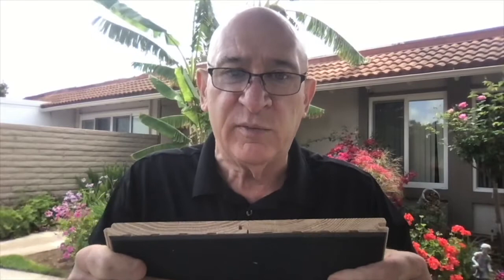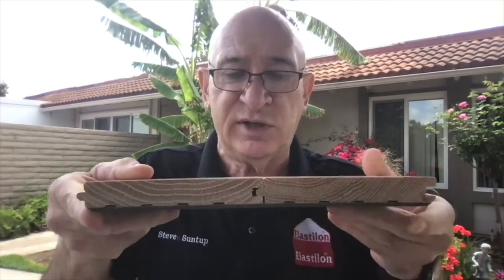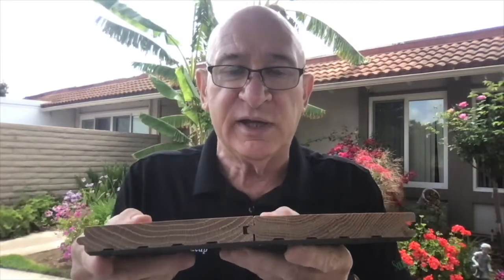There are no temporary sticks — once this is stuck, it's stuck for life. It's a permanent bond. To work with hardwood floor movement, you need to have a permanent bond. Because this product is floating, you can put your poly plastic down and install your floor over concrete, on grade or below grade. And because of the poly plastic, you're not going to have moisture issues, because the poly has a zero perm rating.